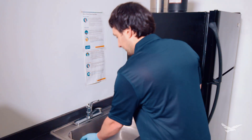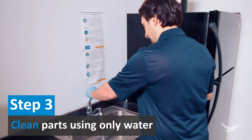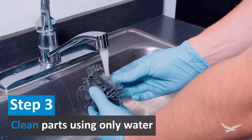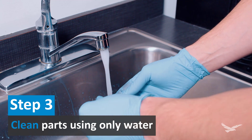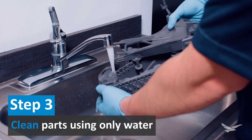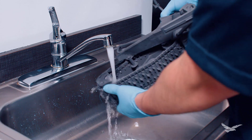Once your parts are processed, the final step is to wash off any excess graphite from the surface of your geometry. This can be done using any source of water, as you can see, and any loose graphite will wash off very quickly. Gloves are optional when handling parts during washing, as graphite isn't harmful to the touch, but it does remove the need to wash excess off your hands afterwards.